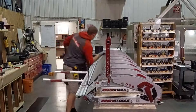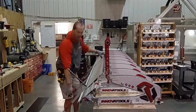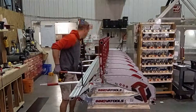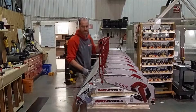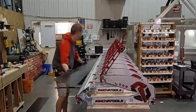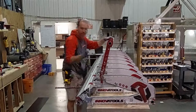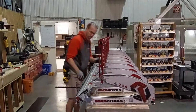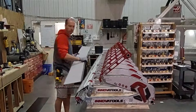Our brake handles it just fine — we're very pleased with the results. Everything is nice and sturdy, tested and proven. It's obviously harder to do steel than aluminum, but the brake can handle it. Our sheet metal C-frames have a lot of strength considering their weight and design. One single bend with just one handle on a 10-foot piece transfers just fine — it's true and straight, a very sturdy hinge and extrusion design.